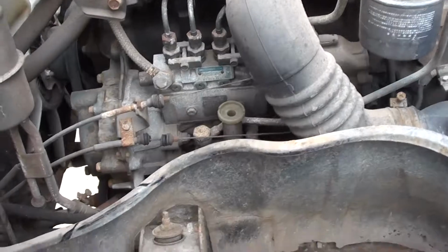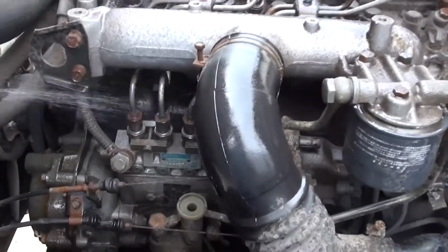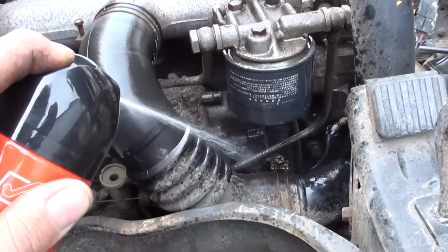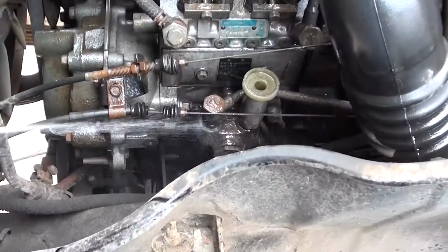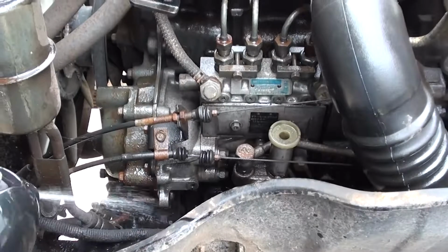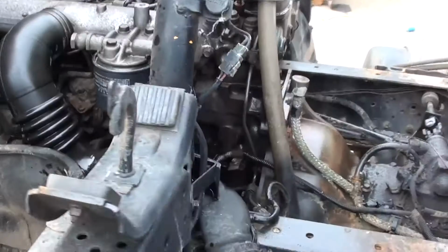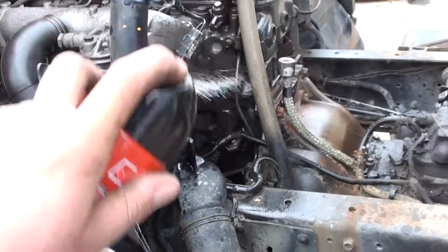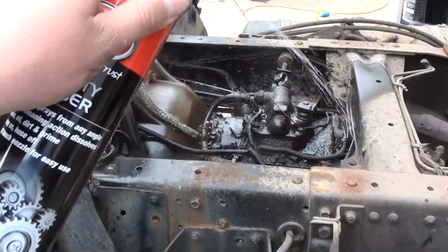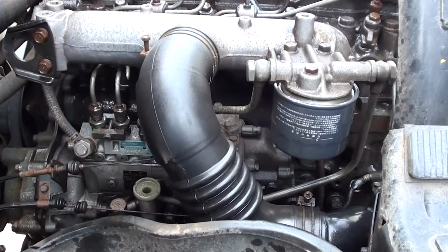Right, so this is more the business side of the diesel engine. Being naturally aspirated, you never expect amazing things, because they're made for long-term reliability and just going forever. So it's something we've got to take into account. But we'll do some research a bit later on the fuel injection and see if that can be gently wound up a little bit to increase a bit of fuel feed in. The boss said it blew a little bit of smoke when I first started driving it yesterday, but it was only blue smoke because it was stone cold. Hadn't been driven for about 4 months, and we started sneaking out of his driveway with it. So it's probably something pretty natural.